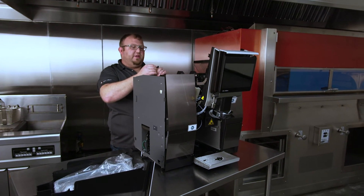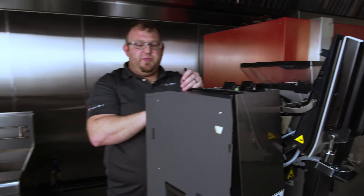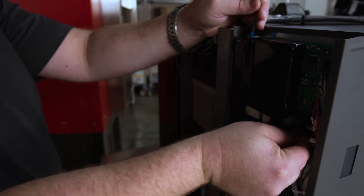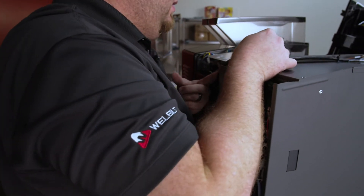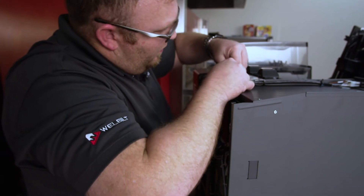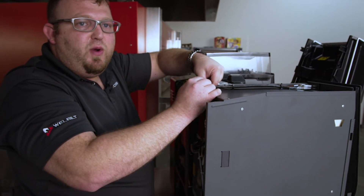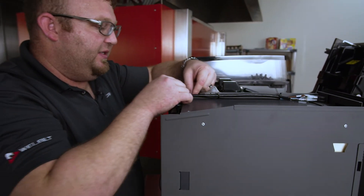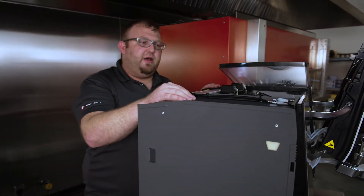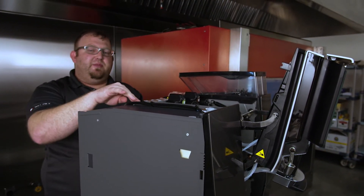The network connections are extremely simple. There is a serial port which is connected to a CAT5 cable that runs to the back of the fresh milk unit. You want to make sure that it is properly seated, and then locate where the serial port is going to be plugged in. You will hear it pop — a quiet snap whenever the clip for the serial piece goes into place. Then you want to make sure that you tuck your wires in, because eventually we are going to hook up another piece that is a cosmetic strip that goes along here. If your wires are crossed or not properly seated, that cosmetic piece will not place properly.